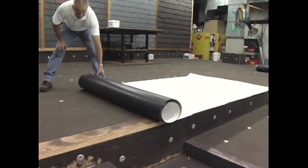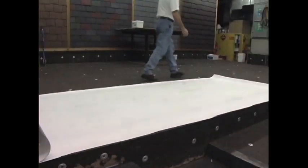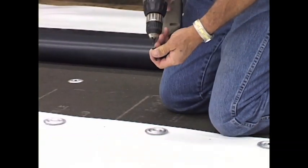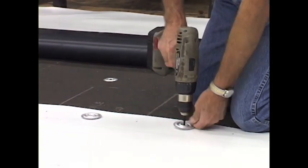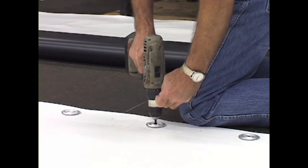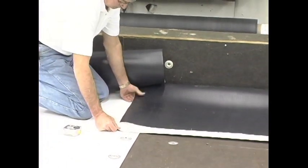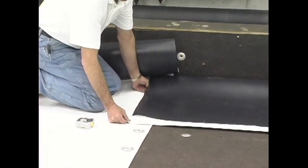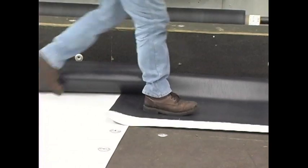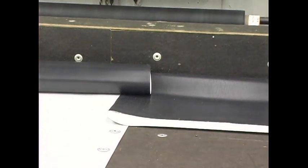Step 2. For the required perimeter securement, position the 4 or 6 foot wide perimeter sheets over the substrate. Fasten the perimeter sheet according to the required number of fasteners for the project — this project requires 12 inch on center fastening. Versico's HPVX fasteners and plates must be used to fasten the VersiWeld membrane to the deck. Position the next perimeter sheet by overlapping the first perimeter sheet approximately 5-1/2 inches, and fasten in the same manner. Utilizing an automatic heat welding machine, weld the two sheets together to achieve a minimum 1-1/2 inch heat welded splice.